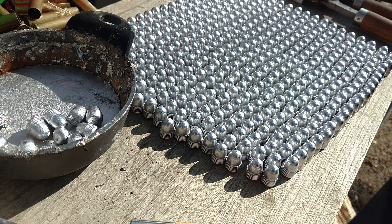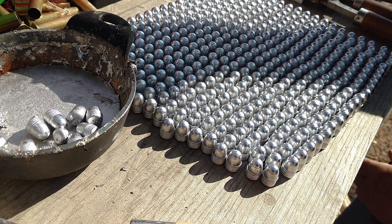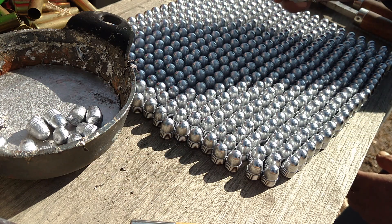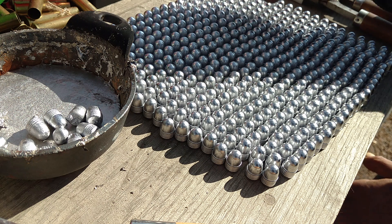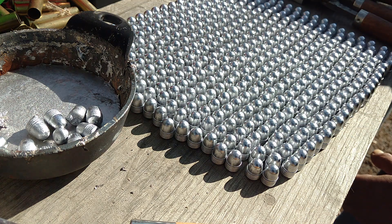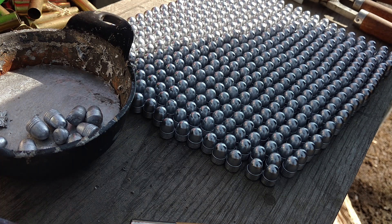There was a guy who was saying about setting up die sets. You have to understand, once I get them set up I run two presses — a three-hole and a four-hole. The four-hole has the automatic powder measure to do some pistol rounds like this, so you just sit there and hammer them out. When I set up dies, I set them up very carefully one time and I'm done with them — I don't touch them again. I have many turrets of both three- and four-hole. That whole idea of pulling them out and redoing them each time ain't for me. I want the consistency you can get by keeping them in the turret, organized that way. Works good for me. But that's going to be a little load to do now.